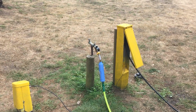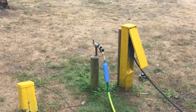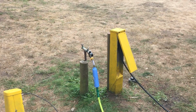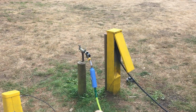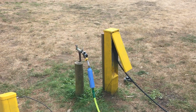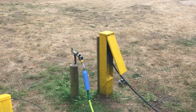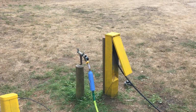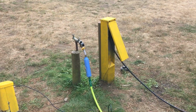And when we booked it, the place is full this weekend, so they can't move us, so we're kind of stuck. The maintenance guys came here and pulled this whole pedestal apart, which I'll show you pictures in a minute of the guy working on it. He had this thing completely apart, replaced the breakers, the plug, checked connections, and it looks like maybe the bus bar is bad on it, so not allowing enough voltage to go through.